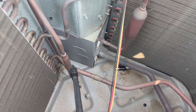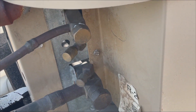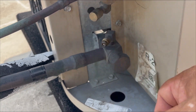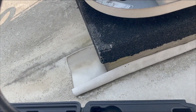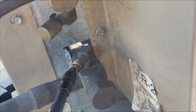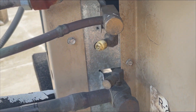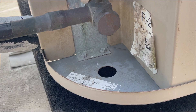It seems like we're okay there — no traces of oil. Now, 99% of my leaks on this property come from the core valves — faulty core valves. So I'm going to open them up and test right now. I'm removing the suction line cap and testing with the leak detector, waiting 30 seconds for it to warm up. Look at that — this is a leak, 100% leaking. Now testing the liquid line — look at that, both valves are leaking.